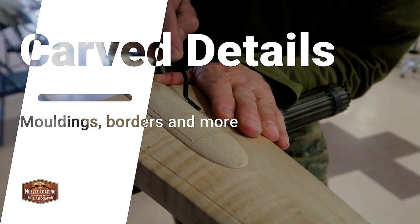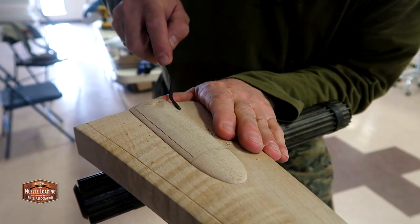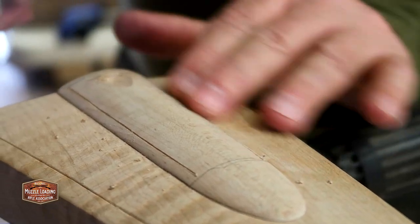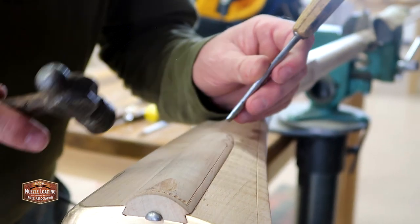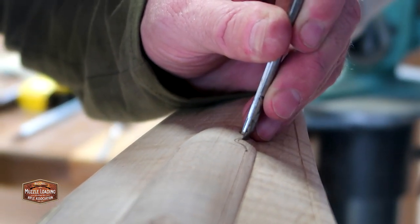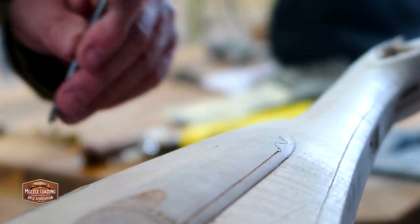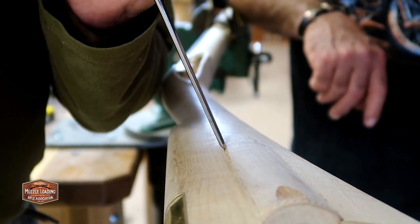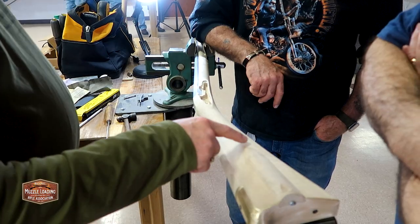With some extra effort you can add even more carved details to your patch box to really make it stand out. Here you see instructor Mike Brooks using a checkering tool to establish a molding line around the border of the patch box — this is really similar to the techniques seen in other videos about adding toe and fore stock molding. To terminate this line, Mike is alternating his gouge to create a vine pattern at the front of the patch box, stabbing or cutting into the wood from the top and then rotating his gouge to create this nice vine pattern. It's easy to do something like this on one side, but much harder to replicate on the other side, so go slow and be patient. The big challenge was doing it without splitting this thin piece of wood right down the middle.